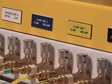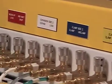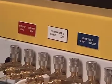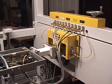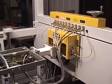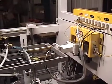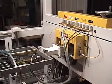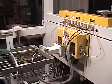Color-coded hoses and tags provide for easy hookup. A separate valve for next-up grid shift operation is provided. Air is dumped on the grid shift valve when the E-stop is depressed for added safety. The SML improved rotate mechanism has been redesigned so that the hoses are clear of the rotate arm and no longer susceptible to damage. We have also lengthened the packer 6 inches to run triple and quad grids. In addition, we have widened the packer 10 inches to provide an additional 5.5 inches of fingered grid swing clearance.